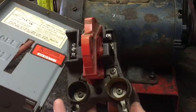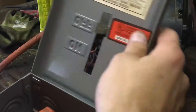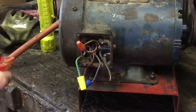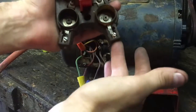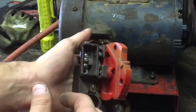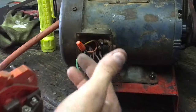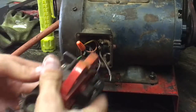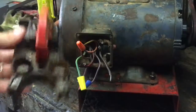We've got a 2-pole switch here. The switch actually comes through the slot here on the front — this will be perfect for wiring this up. We'll take one lead to here, one lead to here. That gives us our two separate 120 feeds and then common up here. So 220 — the only difference — you're going to have basically two 110-volt feeds going to two separate spots here. So 110 here, 110 here, and a common makes 220.